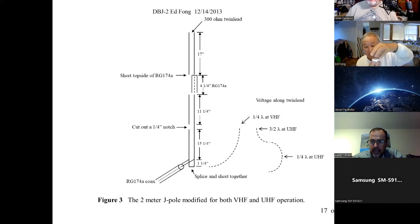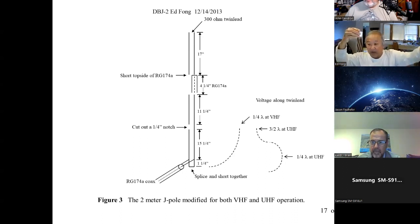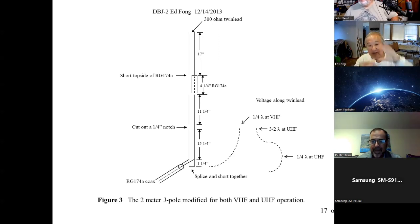So you have your regular antenna here, a DBJ1 or whatever, and it's got two little banana plugs here that you can, as long as it's symmetric, make a dipole, an HF dipole. And as long as it's symmetric, we found it doesn't affect the VHF, UHF too much. I don't know whether I played around. It works pretty cool.